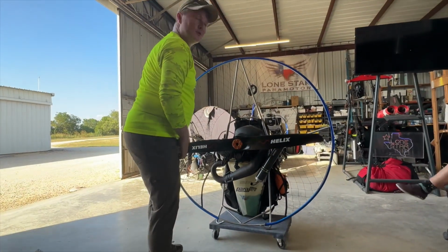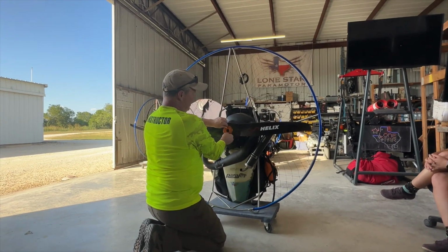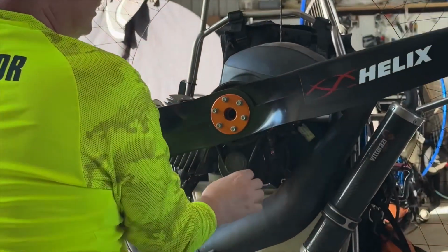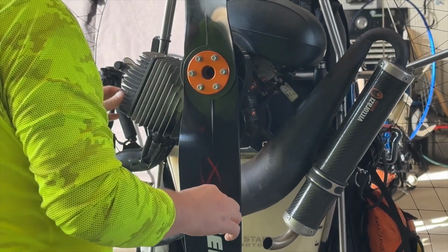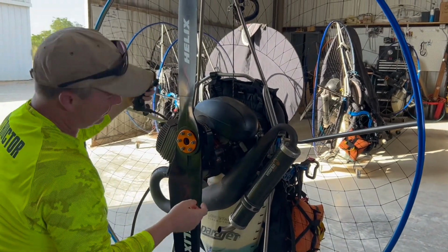And it's about that time to stoop down if the knees hurt. So when I get down here, I'll check the prop nut. It's the first thing closest to me. Next, I'll go over here to the belt. Make sure it moves freely, it's not torn. Since I'm at this level, I also have head bolts, so I'll take a look at the head bolts, make sure they're present.